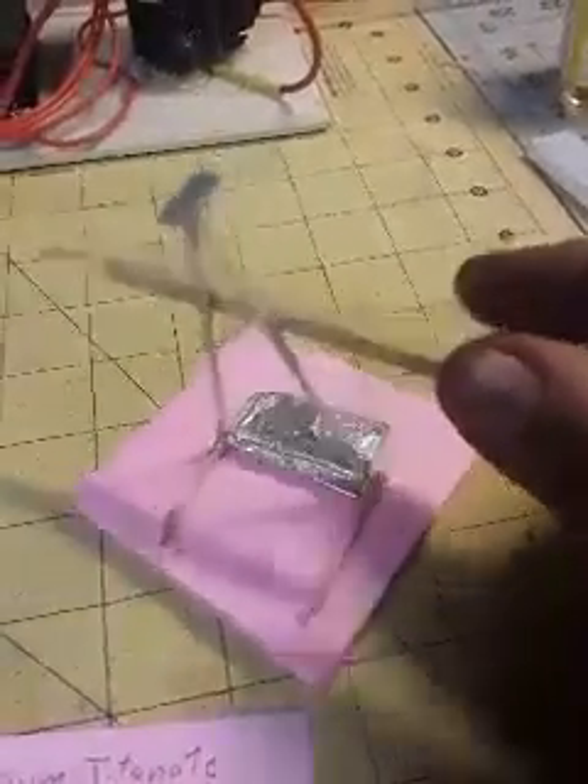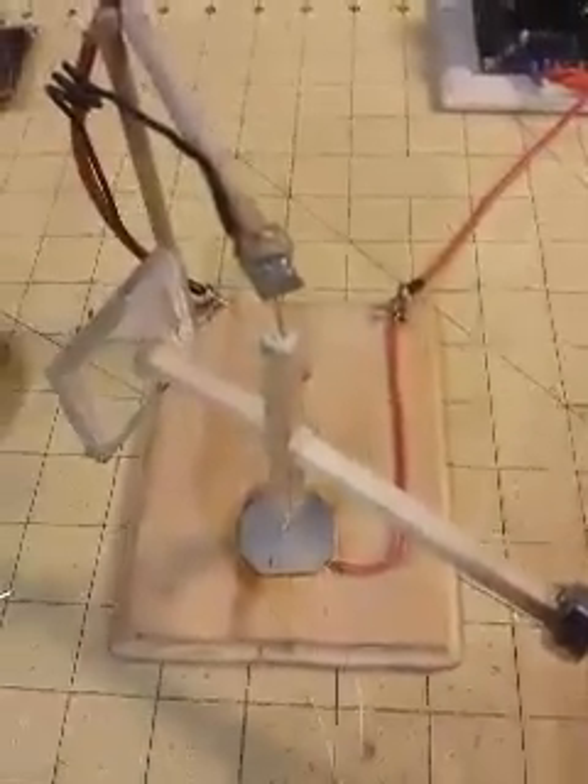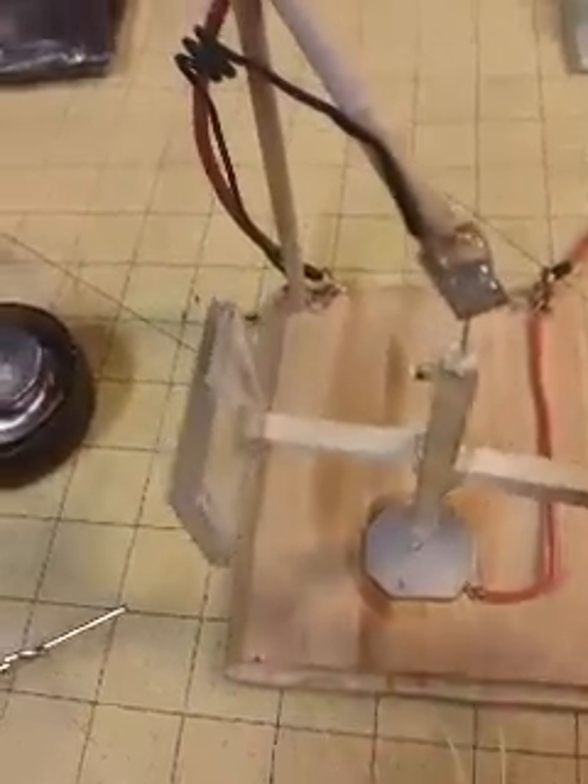This one is entirely different yet similar. It's a balanced setup using polycarbonate. You can see the corona wire — I'm using copier corona wire as my emitter. The plate is embedded in the Lexan, so this thing does not run on corona wind.